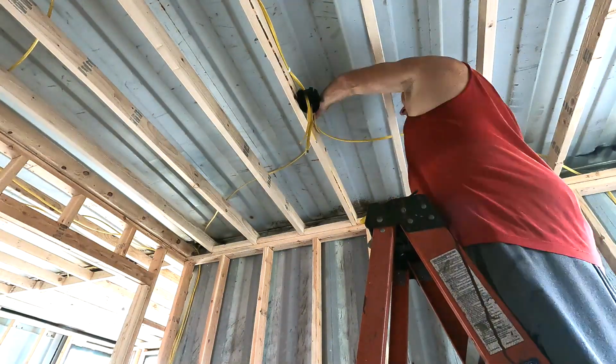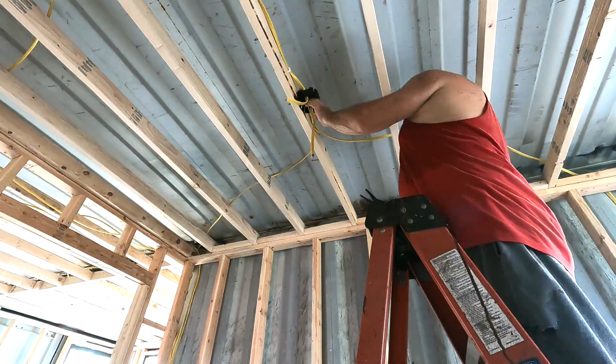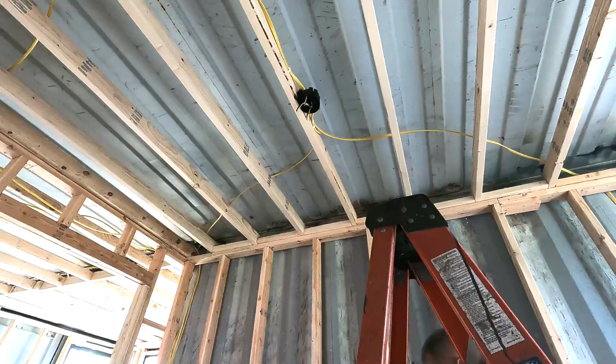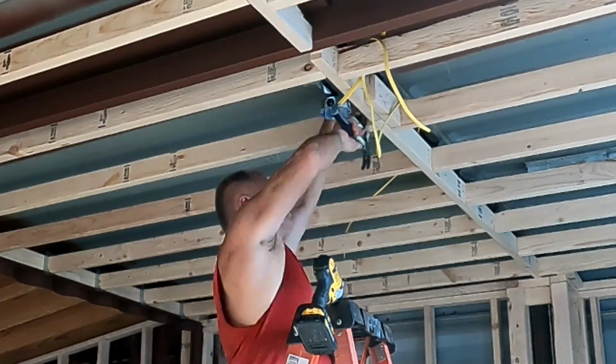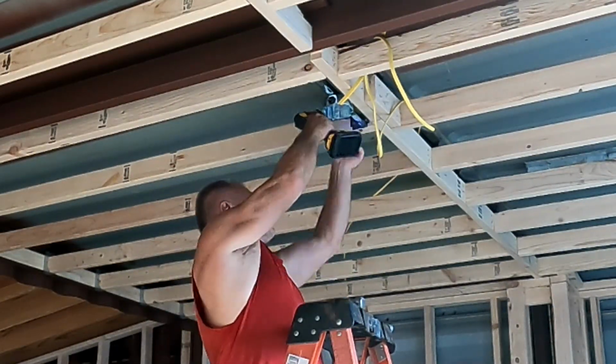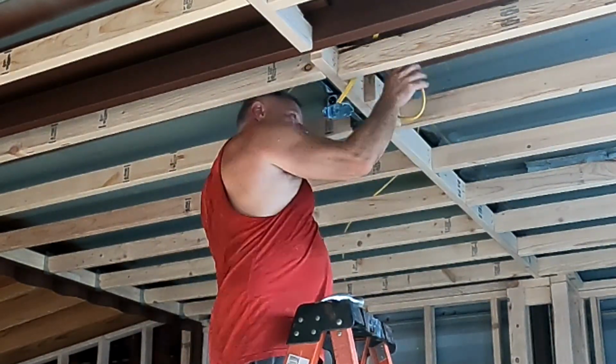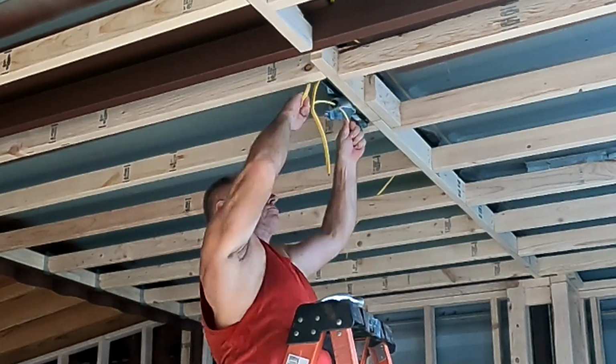So tightening up some of the wires, then I stripped this. This is a light switch in the apartment. And then I clean it up, snip the wires, and pull the romex off. I'll show you that in more detail later. 12-2 is no problem. The tool does that. 12-3 I just rip the yellow romex sheeting off and then just pull on it. It comes off pretty straightforward.